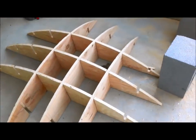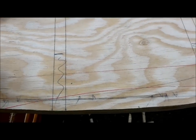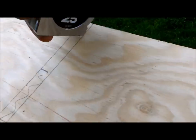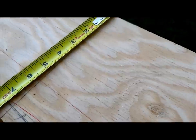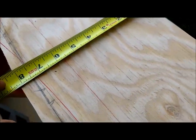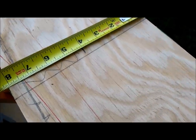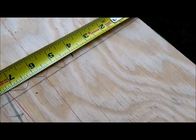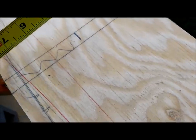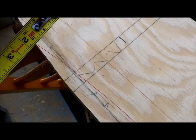So let me tell you what I've been doing up to this point. I've taken the boards and marked the midpoint on each of the stripes where you're putting the slots. How I did it — if you take the whole measurement, this one is a little over 8. You want the slot to actually be a little bit longer than normal, so I did barely over 4, because I want the bigger end of the half to be there so that when you cut it, it slides down easily.